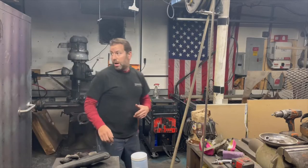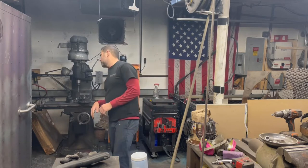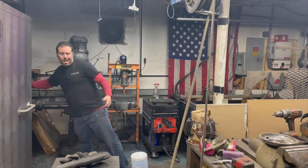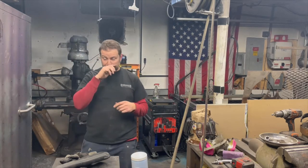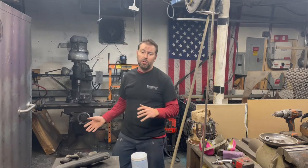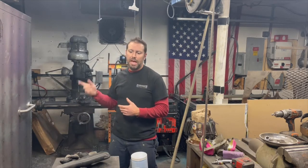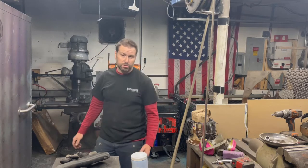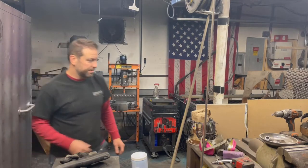Okay, now ready to pull it out of the oven. The primer's been on there 10 minutes, and I jacked the heat a little bit to try to get some more heat into that main thing. I'm just going to go right over it with the maroon where I want the lettering, so that I can then let it cool and do the baby blue after that. But I'm going to do a couple parts in that maroon red so it kind of gives it some accents on it. We'll see how it goes. Worst that happens is it doesn't look good, which is fine by me.